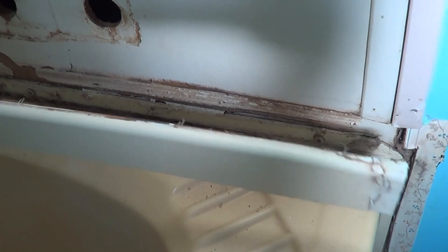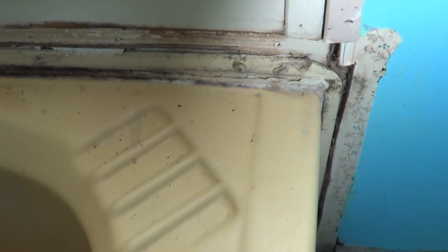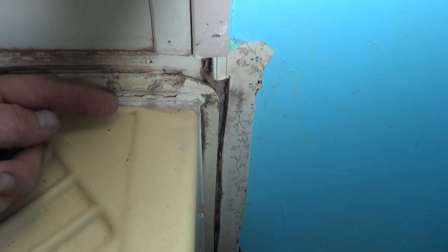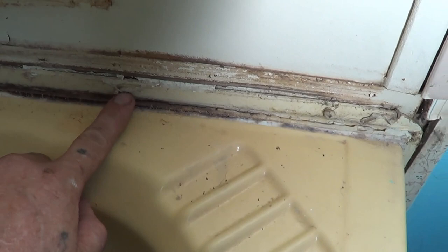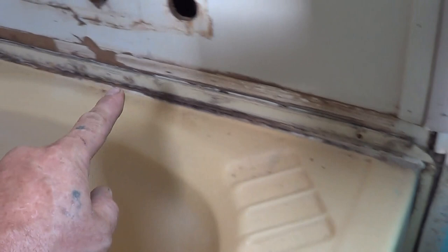So we got this piece off — we can see how it used to be on there and it got torn off. They staple a piece on there sometimes and push it onto that and screw the edges. We can see there's an edge on the tub, and the piece coming down over that is supposed to prevent water backing up. We can also see there are some screws periodically around that will all have to come out. We removed all the screws. There's also a little flange down the side — we need to make sure that's unscrewed, the top piece all the way around.